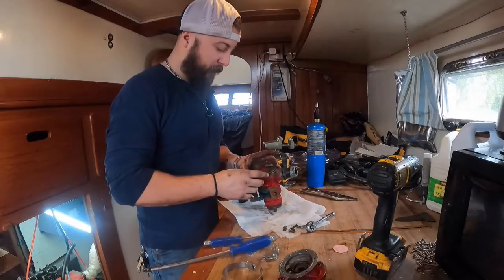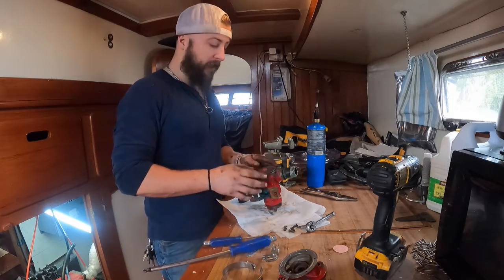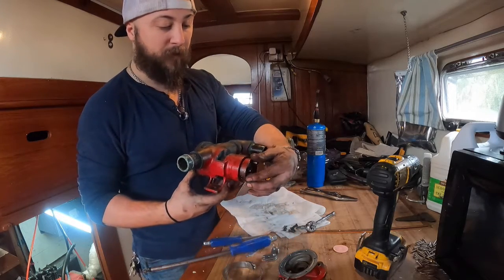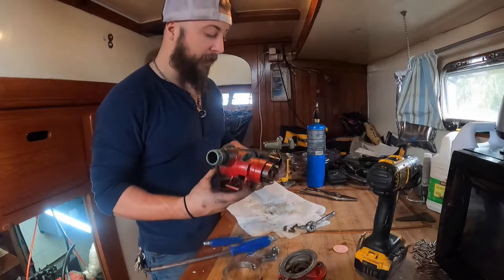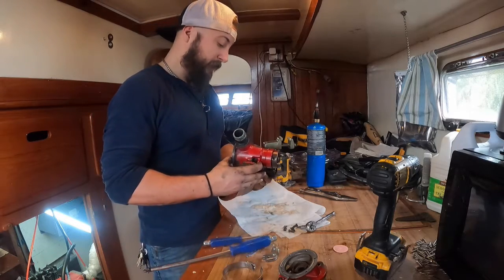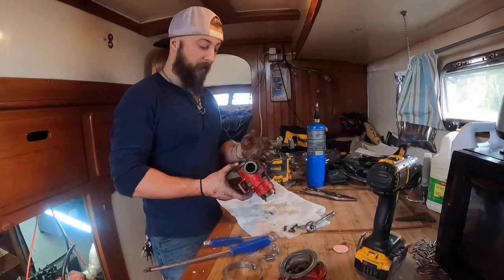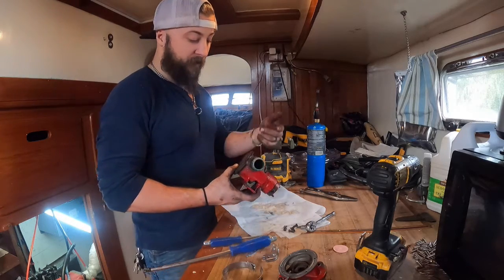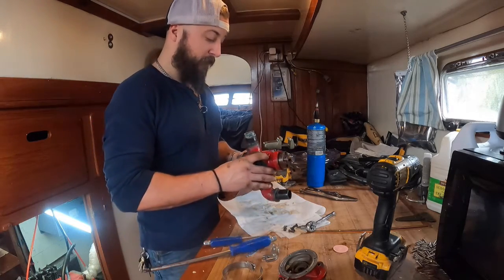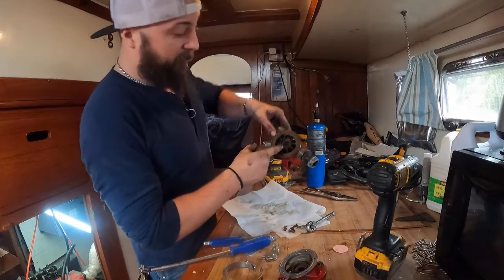Alright, so I got the raw water pump off. I moved over here because my knees just about had it over there. I already took the six screws off the main cover. If you're not familiar with the raw water pump on a boat — just as it sounds, you have a shaft drive, and in our case it bolts on the back of the injection pump. It sucks in water from under the boat, runs it through a heat exchanger, and cools the engine. These have rubber impellers in them which are just a wear and tear item. Took the six bolts out of the cover and this is our rubber impeller here.